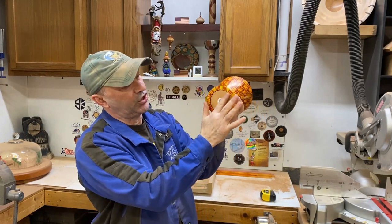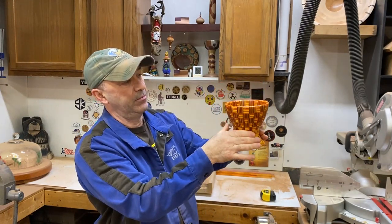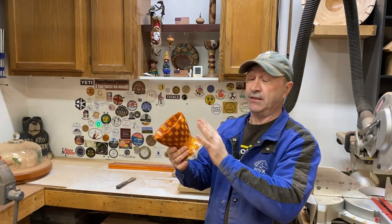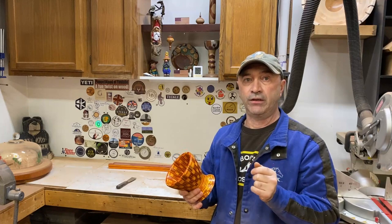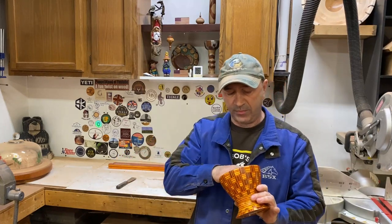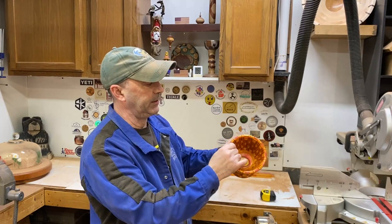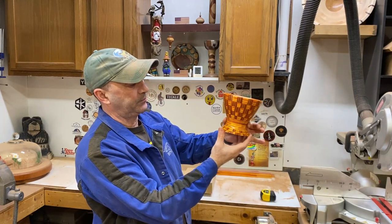I put this piece of cherry in the bottom to hold my emblem. I just love it. I mean, this colored plywood, really, it sanded nicely. It cut nice. The only thing, you can't use your standard tools on it. It just dulls it right out. But your carbide tools make a nice clean cut. Sands nicely. But I really like the way this came out.